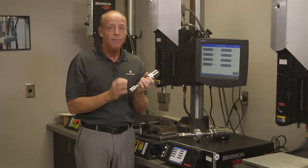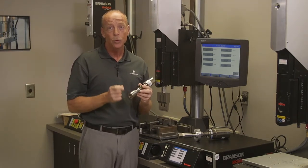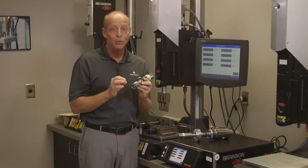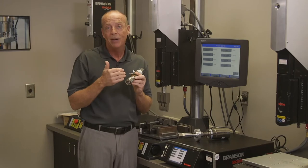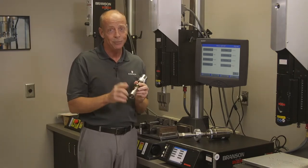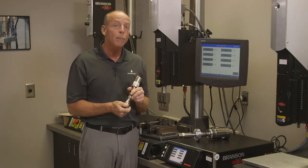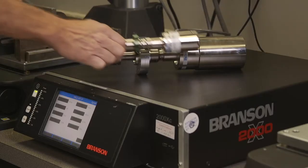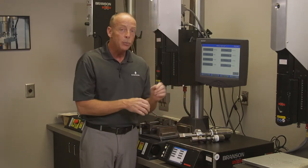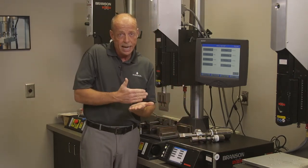One of the distinct advantages of ultrasonic sealing over thermal or heated bar tooling is the ability to adjust this amplitude to precisely the amount of frictional activity needed to seal the product without degrading it, which is a significant challenge with bio-based materials. So the ultrasonic stack is very clearly defined to match the application from that contact side.